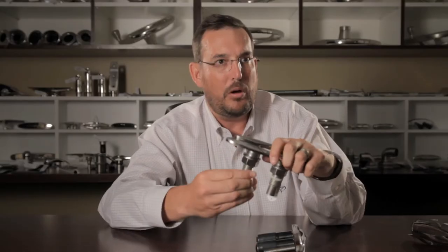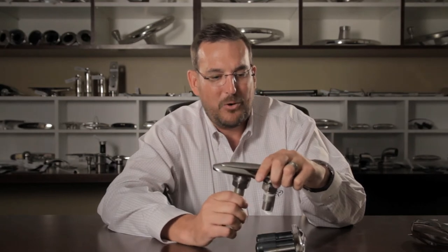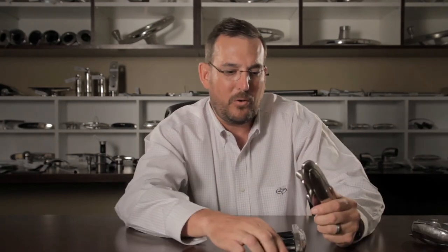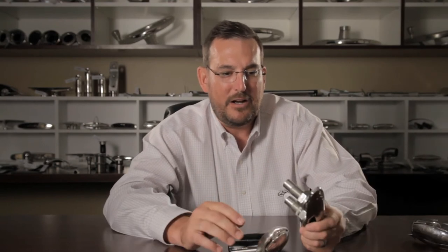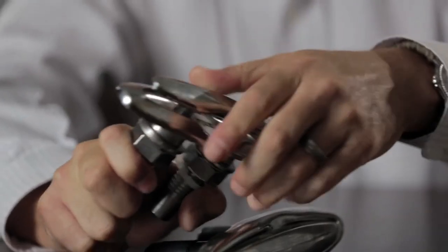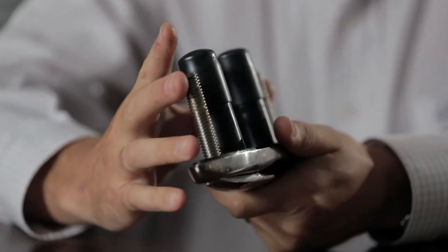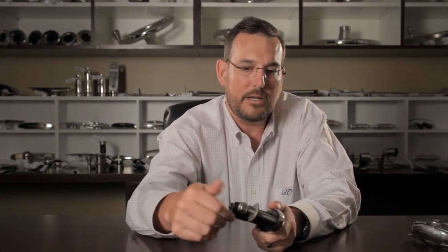That's completely different from our competitors' cleats or even our old cleats, where water is actually designed to go down through the cleat and drain into your boat. That involves plumbing the cleat — you have to put plumbing caps on it and run that plumbing somewhere, either outside the boat or down the bilge. So when we get questions about preferring two holes over four holes: when you factor in the install time of putting plumbing caps on the cleat, plus the disadvantage of a two-hole cleat getting bound and not being able to pull up well, we are firmly convinced that the four-hole cleat is the best way to go. It gives you the best, most reliable install and a waterproof install, and of course we have full-size washers and full-size lock nuts that go on during the install.